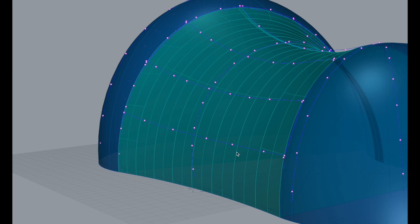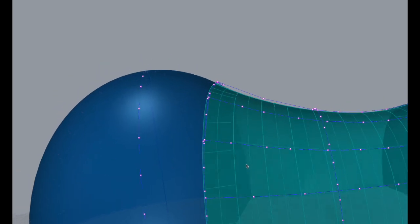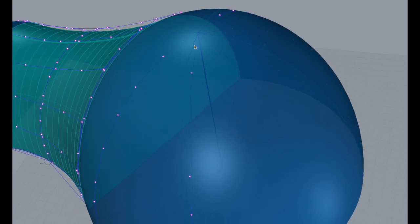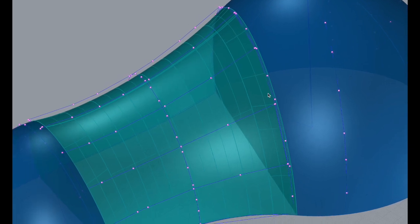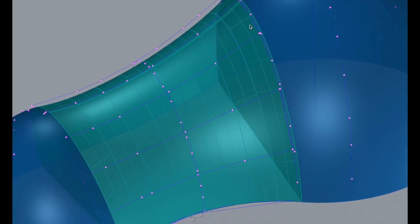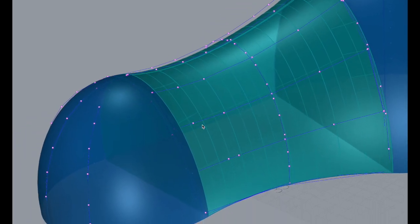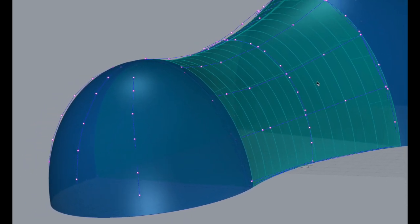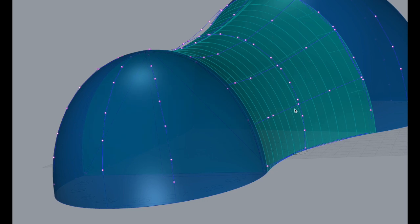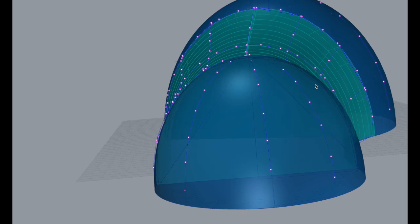And then we went back and put it up to 4 inches of pressure. And I think that was really fun because the top center of this dome came back a lot better where it was supposed to be. And the dome is just about the right profile. And you can see that it kind of grew all around here, but it grew in the shape that it was supposed to. And then, yeah, the saddle really, really grew. So then we didn't exactly pattern it for that kind of pressure, so I'm not surprised to see that it has expanded out. But yeah, you can still see how much more round that center portion is.